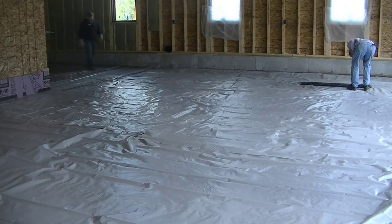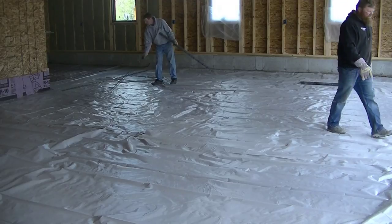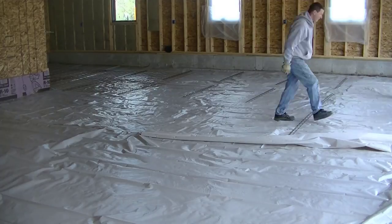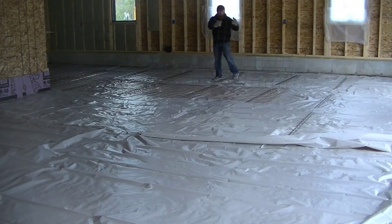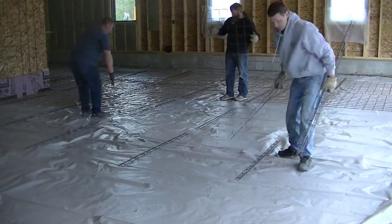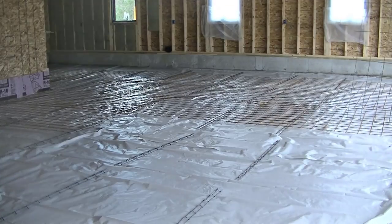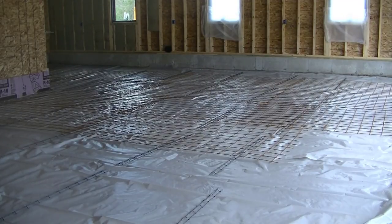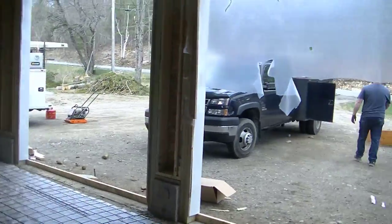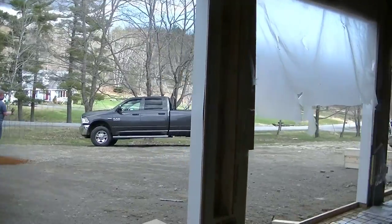Hey guys, if you don't know me, my name is Mike Day — I own Day's Concrete Floors. All my videos, I come out with two a week, they're all about concrete flatwork, stamp concrete, concrete repair, even epoxy floors. If you like that kind of stuff, go ahead and hit subscribe. If you're getting any value out of this video, I'd appreciate it if you'd smash that like button — it really helps with YouTube's algorithm and gets the video out to more people. I'm laying those slab bolsters every four or five feet just to keep the wire up, because wire doesn't do any good laying right on the bottom. We'll end up using fiber mesh in the concrete also, so it'll have a double reinforcement. Make sure you subscribe so you can come back and watch the video of us pouring and finishing this — we're going to pour it and power trowel it.